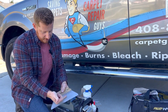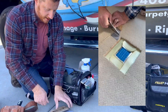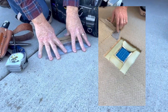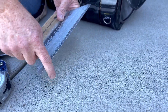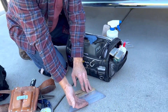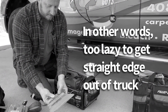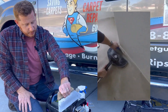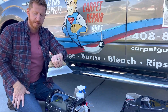Here's another tool. You can see all the thousands of cuts and lines and grooves on it. I use this when I'm cutting to protect the existing carpet on the ground when I'm cutting my patch piece. I use it both as a straight edge as well as a layer of safety between the carpet when I'm cutting. You can also use it when you're stretching to push the carpet into the gully between the tack strip and the baseboard.